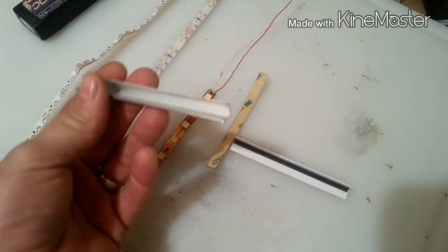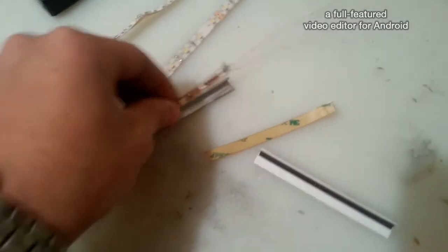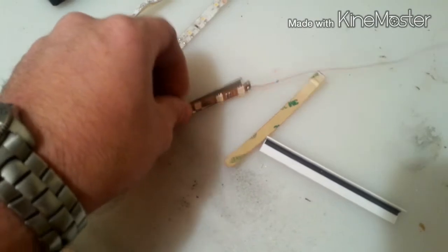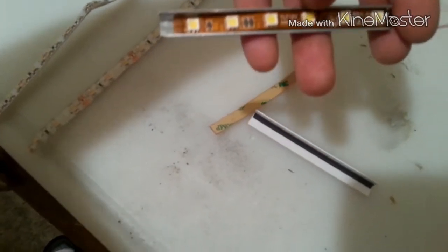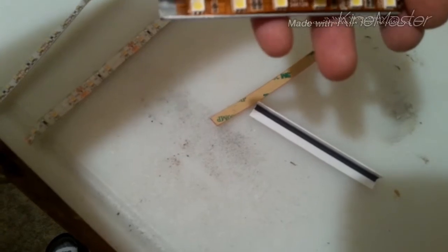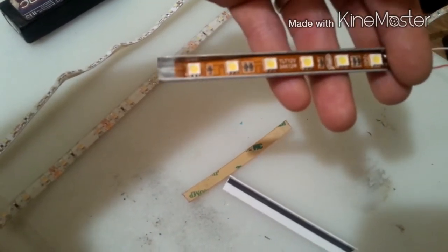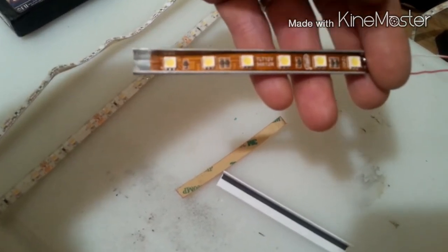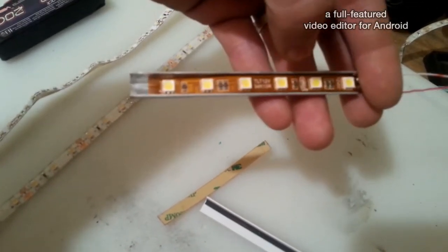I used the small metal brake I had bought online and bent up some aluminum, and I have some clear Lexan that I could put over the front of it. I could cover up the actual luminaires themselves and then paint the circuitry if I wanted to. I'm probably going to waterproof it with some conformal coating that I have coming. But then I could paint it black or whatever, as long as I cover up the luminaires. That way I wouldn't have to worry about the paint ruining them where they would be useless. But that way you wouldn't see the circuitry. All you would actually see is the lights themselves. And then mount that somehow on the roof.